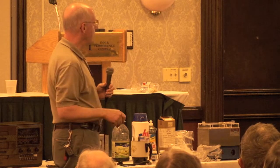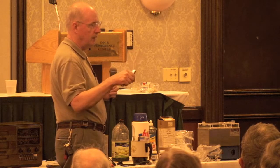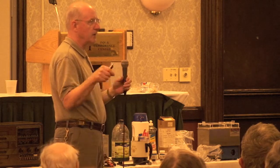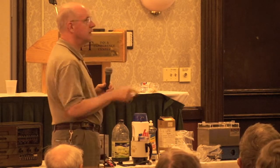And if you've cleaned brass, the old timers, when they coated their brass, they actually used tinted lacquers. And you can take and put oak wood dye. If you take a few drops of aniline oak wood dye and drop that into your teaspoon of lacquer that you're using to coat, say if you're restoring a telegraph sounder or something like that, it'll give it that nice, warm, kind of old look.